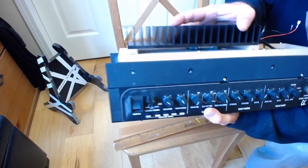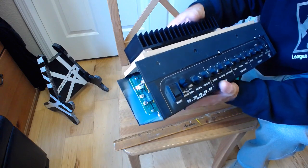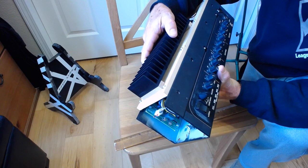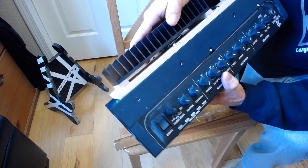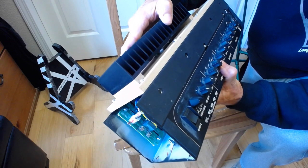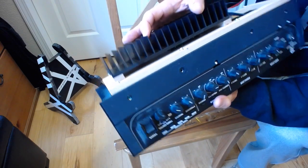And it's probably a pair. There's probably 250s sandwiched together in a common ground. I imagine it's some sort of CMOS device, but it's clamped in there pretty good. We've got a thermal disk, we got a big fat heat sink on the back of that IC, and it's probably a matched pair of CMOS components in there with a common ground for 7 pins.